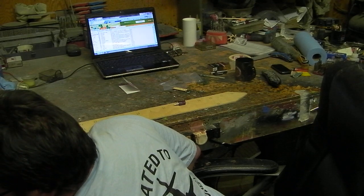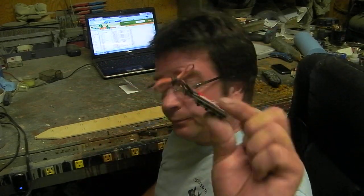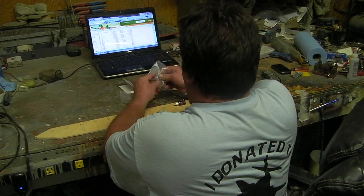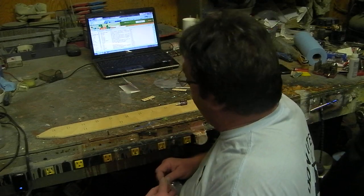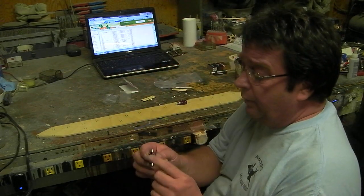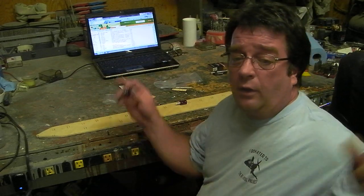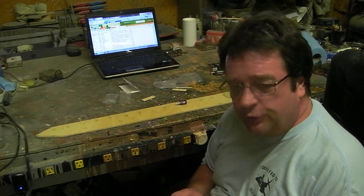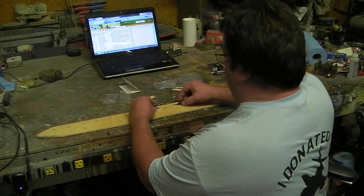Got the whole box of goodies here. Gear door sequencers — I got three of these: one for the canopy, one for the mains, and one for the nose. I just hook them all up separate. It's really going to keep the airlines down — they won't be scattered all over going through the airplane. That way if you're going to get a leak, it'd be a lot easier to trace down. All the airlines going to the gear are going to be super short, so it won't take a lot of air to cycle the system. If you got real long airlines, every time you cycle the gear you're using the air in them airlines too, plus what's in the cylinder. Anyway, I'm gonna put them right there.